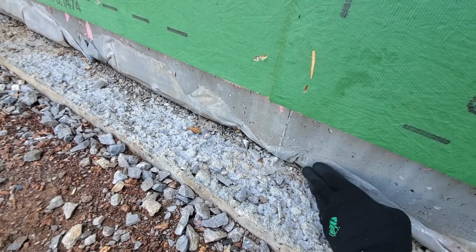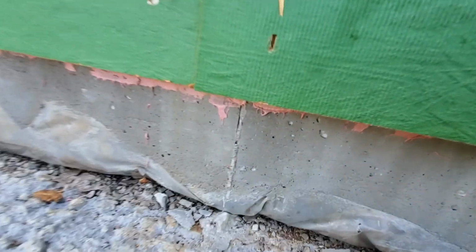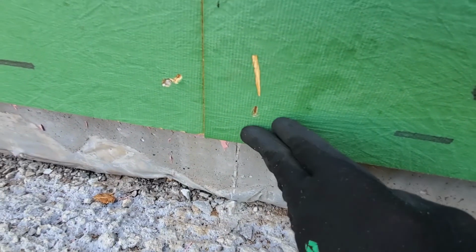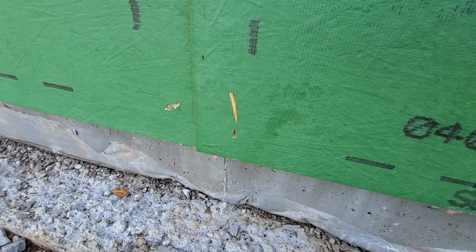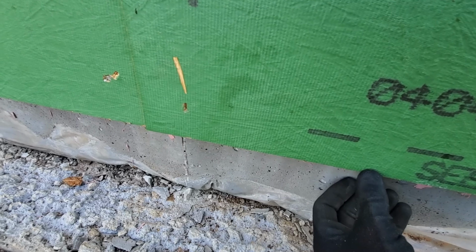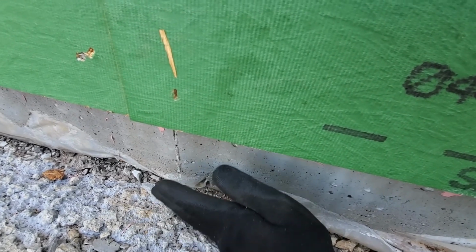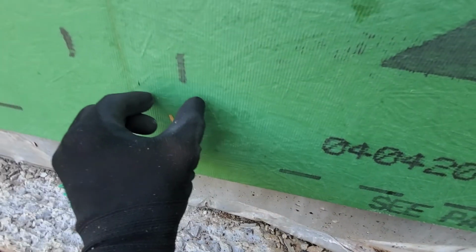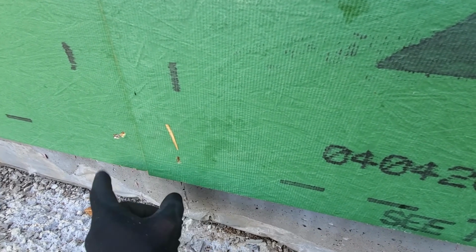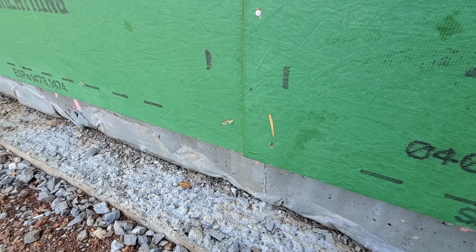I also wanted to have the insulation come down smooth, and then I was going to seal that off. I already have, you can see my sealant under there for the framing. Oh, just a nail there. So now I'm going to come back and go ahead and seal under here with the same material, and then I'm going to take 1.5 inch foam and cut it to length and slap that up against there. Then my 1-inch foam is going to come down and dead end into that 1.5 inch, and then I'll probably tape that as well. So this ought to work out pretty good.